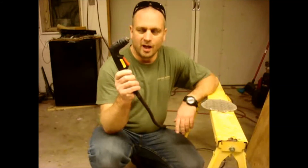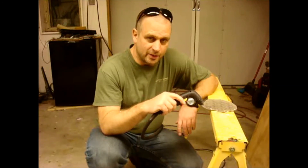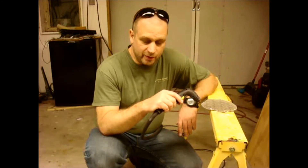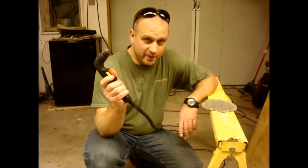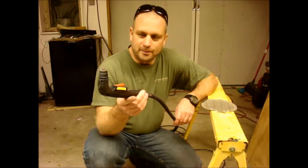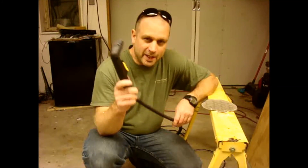That's basically it. The plasma cutter will go in and cut metal — in this case a small unit will do up to quarter-inch steel with no problem cutting this 3/16 inch alloy. It'll cut brass and copper too. I free-handed this, and I'll just take a file and knock off any burrs. You can certainly set yourself up with a jig so you have virtually no rough edges. This little unit will really improve the quality of your life if you're doing any basic metal work — it's phenomenally handy for freehand cutting, sculpture, field repair on heavy equipment, and plasma cutter body work.